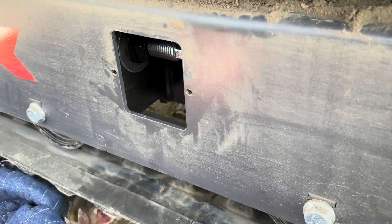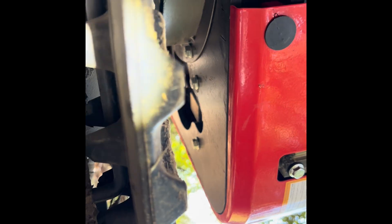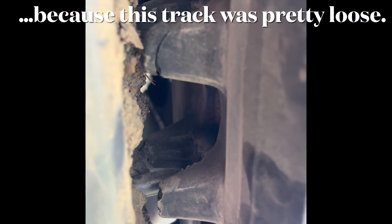It's actually pretty easy to do once you have the right tools. Can you see the little rod that's welded and coming up there into the bottom of the track? That runs back and is a guide — about 10 inches long maybe. I have not seen, looking around the internet, any other brand of small Chinese excavators that have that. I believe that's to help prevent you from throwing the track off as easily. And while it didn't stop it completely today, it may have helped it from coming off completely.